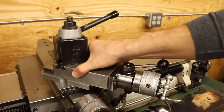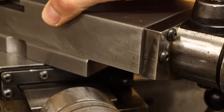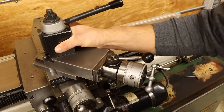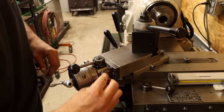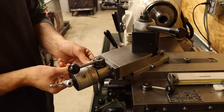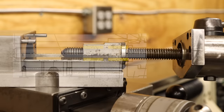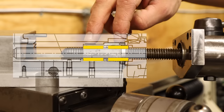Back to the compound. I saved the best for last. Yeah, it shouldn't do that. This is called backlash, and pretty much every machine with lead screws or gears has it. But this is a bit extreme. And not in the yeehaw cowboy kind of way. Now before you ask, yes, there is a way to adjust this. Inside here, the lead screw threads into this body where there's a pair of bronze lead nuts. Normally you can adjust the spacing between these nuts to take up the excess backlash.